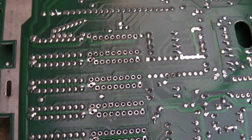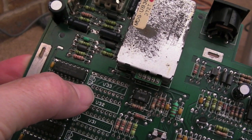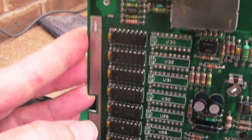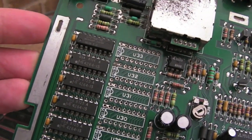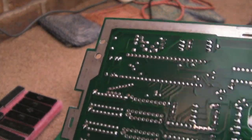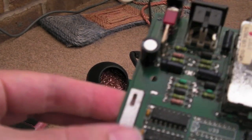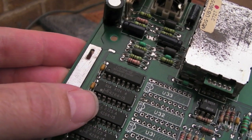All the solder is unblocked. The board's a bit of a mess just because it's dirty — once it's been cleaned up it should look good as new. Looking at the top side of the board, you can see these bypass capacitors to the left of each chip: C120, C119, 118, 117, etc. I've unblocked the holes for those as well. Put it up to the light to make sure you can see through all the holes. It's all come off with a desolder pump via the other side of the board. I'm not sure about the cap size — I'll have a quick look at the schematics. They're going to be something like 0.33 microfarads — might be 100 nanofarads.